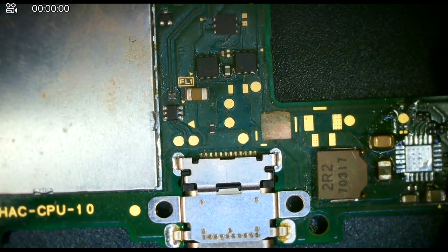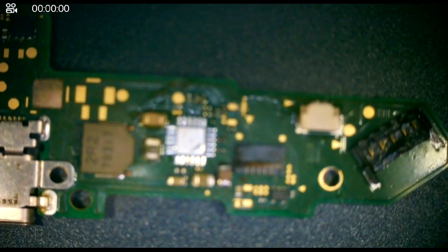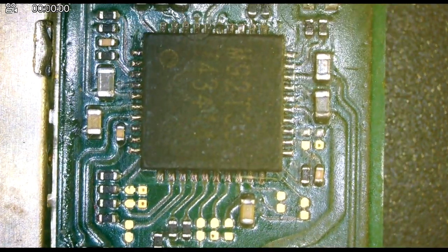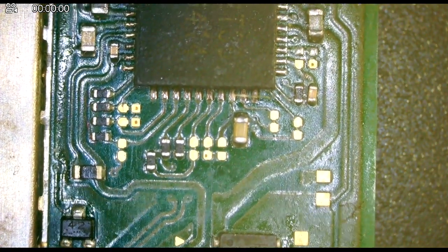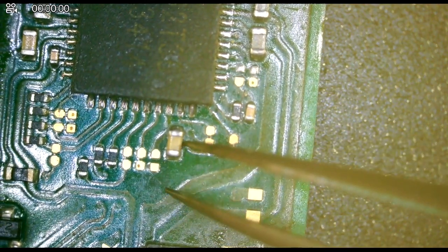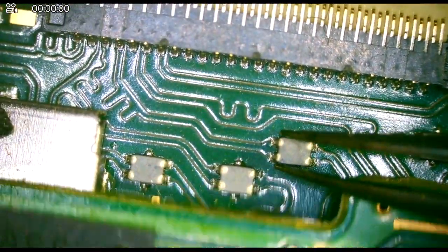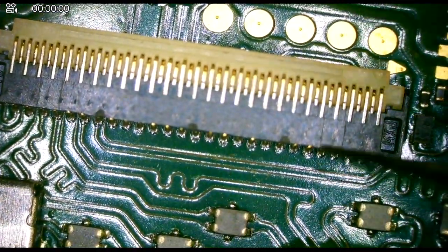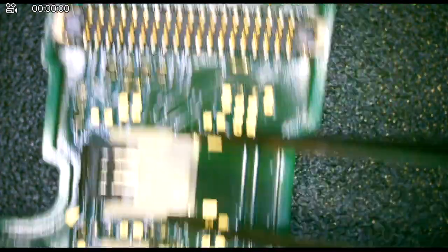The video quality here is definitely comparable to the Northridge Fix microscope that I already use on a daily basis. The working distance I have is roughly three inches, so even though I can zoom in this close, the working distance isn't great for very small BGA work or component rework — there's not a lot of space to grab a component, and using hot air up this close isn't really feasible. For analyzing and diagnosing boards, though, this scope would definitely be my pick.